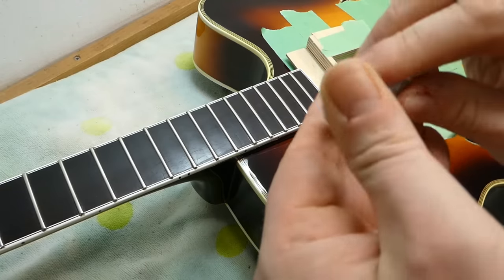I'm going to take out the old jack. It's a rather stout piece of wire — save the jack. And this is what I mean when I say that drilling a half inch hole is too wide for the barrel of these jacks. You can see just how deformed this washer is — it's cupped inwards — and if we look at the hole in the end of the body, I suspect we'll find that has kind of mashed inwards as well. Yeah, it's almost like it's been countersunk. So it's better to have something like 12mm.